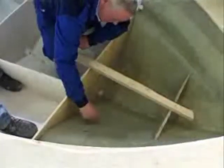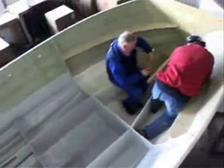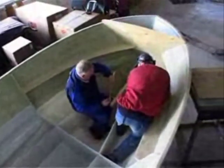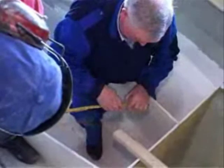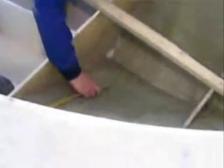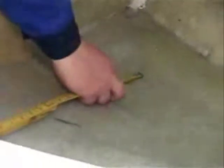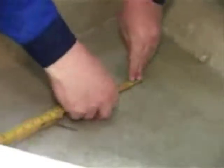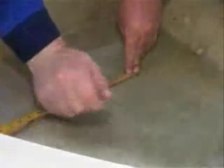When you have found the desired tunnel position on the outside of the hull, it is a good idea to check that the tunnel will fit the inside of the boat in relation to bulkheads and other obstacles. It can be difficult to find the interior tunnel position in comparison to the outside, so it is a good idea to use tangible or easily recognizable measuring points that can be seen both on the inside and the outside of the boat, such as the hull or windows, as guidelines.